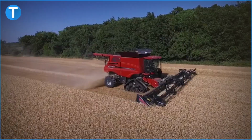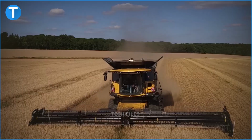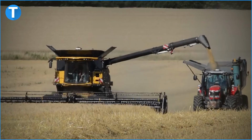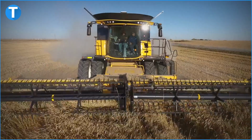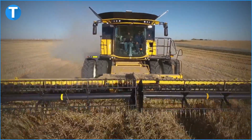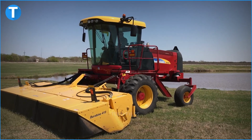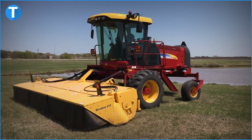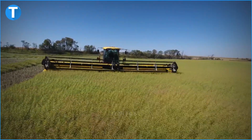Although widespread experimentation with pushing is still absent, it appears that it may work better in some crop situations than in others. Tall, even crop growth works better with pushing. The idea is to push the stalks over, but not break them off or rip them out of the ground. Vertical sickles at both ends and directly in front of the tractor tire tracks are designed to ensure a clean cut between passes and reduce the amount of canola crushed to the ground by the tire tracks.